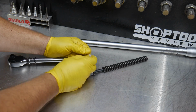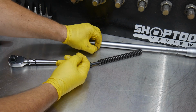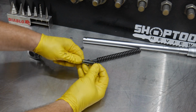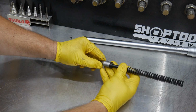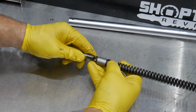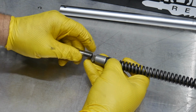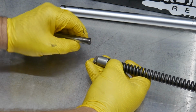And what happens is these two ball ends here on this little key actually ride in that shaft like this. So it's inside there, and that shaft keeps it from riding too far up or down. And as extreme force is applied, it actually makes this pin roll. As it's like this, there's side force applied that makes it kind of break away. It does just like that. And as more force is applied, that rolls, and basically it jumps to that next side, and also this slaps, pop, against the side of the handle. So that gives you that positive click sensation as well as hearing that click.